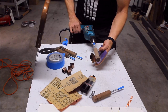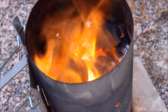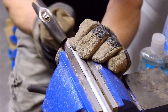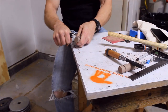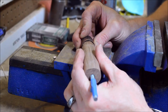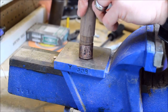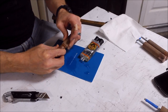My hands were getting pretty hot from the friction of sanding, but I've got to pretend to be tough. Adding these copper caps is an example of how I just keep wanting to add one more detail that drags out a project. Before the caps could get installed, the handles had to be trimmed a little bit. Getting the caps to fit took trial and error — when trial and error fails, get your hammer out and make that round cap fit that not-so-round handle. A bit of epoxy was used to install the caps on the ends.